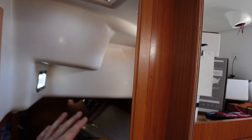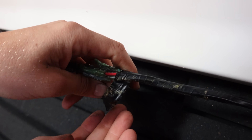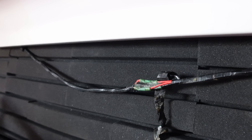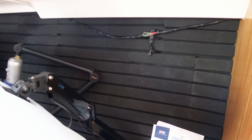Luckily we stuck our head in and saw just the slightest bit of green past some electrical tape and found it. We crimped wire number 53 and we still don't have power to the whole back cabin. Sasha found another place with green corrosion coming out of a butt connector — no heat shrink on any of these connections at all. This is why you have to go through and look at every single part of your boat. We've gone through every wire on this boat. We think they may have switched wire numbers too, which is why it's messy back here.